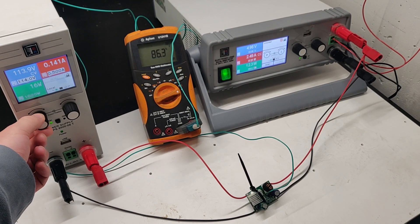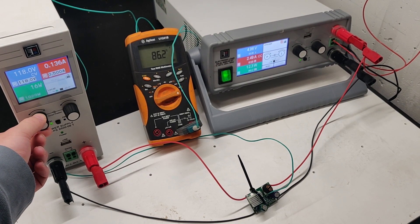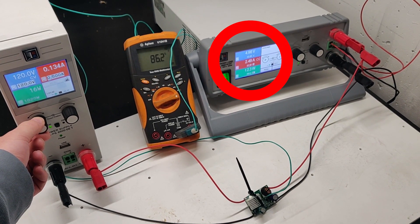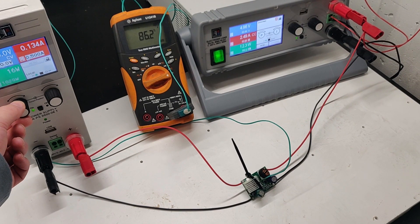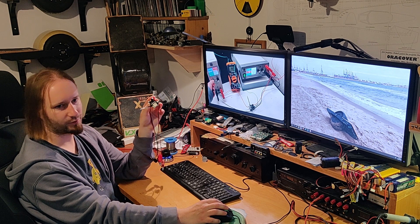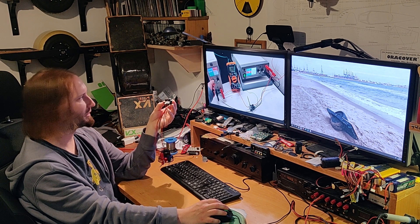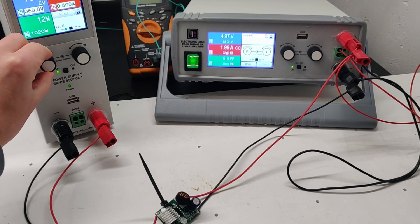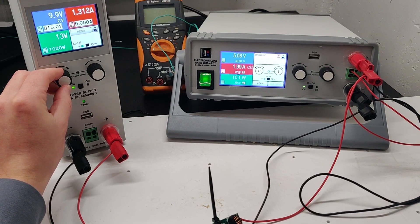Since the test is nearly finished, I raised the input voltage back to 120V. This time the output stays at 5V where it should be. This tells us that one of the original components was of poor quality and ended up working improperly just above 115V. When I replaced the MOSFET, diodes, and capacitor with non-Chinese components, the thing actually started working as it should. Dropping the input voltage all the way to 20V and then 10V — everything looks fine.